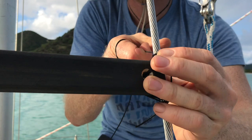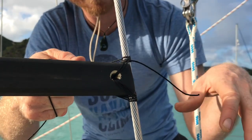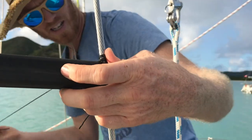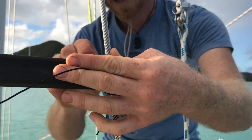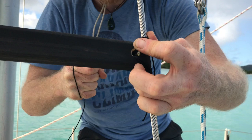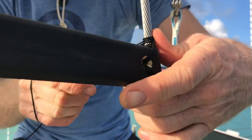So I've done my four down the bottom and now I'm ready to do my top. I find it easier to finish at the top because we left this long — we're going to tie it off here so it's nice and clean with the finish. Same deal at the top as the bottom — give it a wrap, keeping it nice and tight. If you keep them all going the same way, you end up with a nice clean look, which is particularly important for the ones on deck because you'll be staring at those a bit more. The ones aloft can be a bit messier.